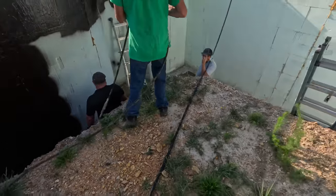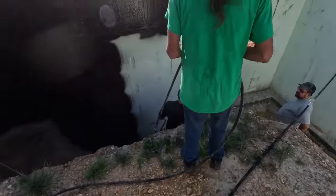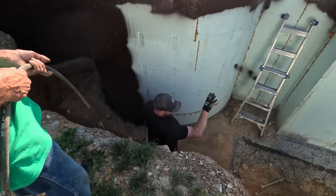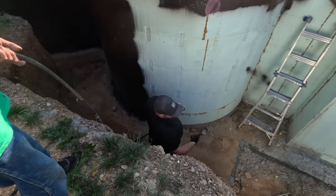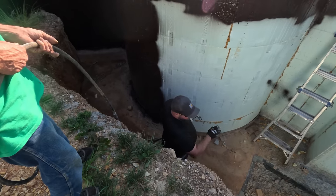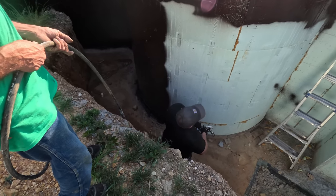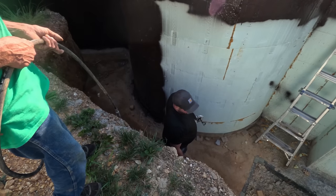So if you're not doing gravel at all your step downs, you would need to run a vertical piece from this footer where it goes down. It's going to have gravel. You just have to extend it past the footer, so any water that falls out of it goes down through the gravel into the next layer. Gotcha. Hardest part is splicing two together.